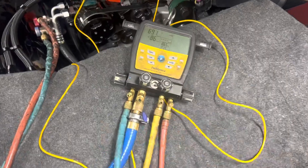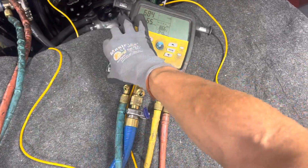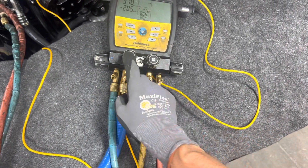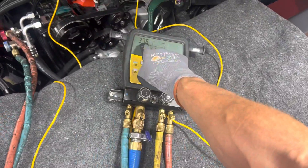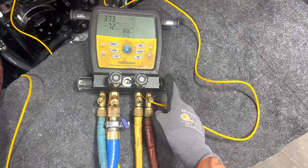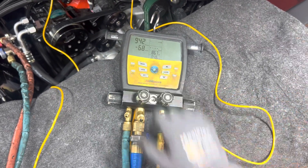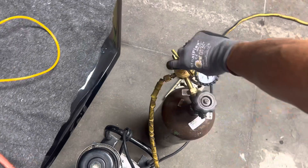I'm going to close the low side and force all the nitrogen through the high side. We need to close the vacuum because the vacuum pump is on. You can see it's down to 375 microns going through the high side right now, so let's shut that down — and it'll jump back up. I already have the nitrogen on and already cranked the regulator up a little bit.